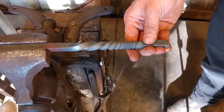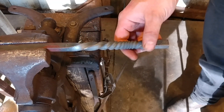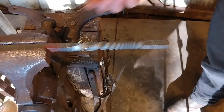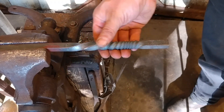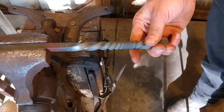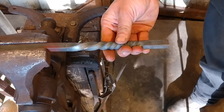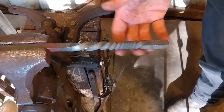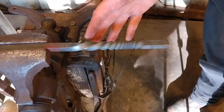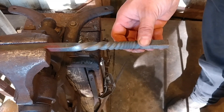If you have a good clean forging that hasn't been all burned up and heavily scaled, it makes the next stages and finishing a lot easier. Usually it'll go to stage three: I will use a mechanical means of finishing of some sort, whether that be sanding, sandpaper, wire wheels, buffers, scotch-brite wheel, flap disc — whatever I need to do to take off whatever is rough or that I don't like about the piece.